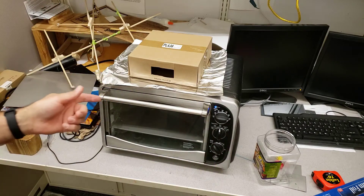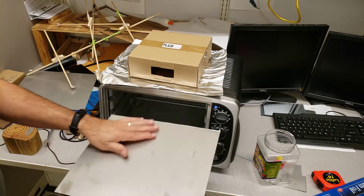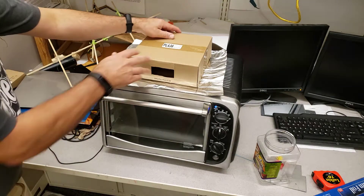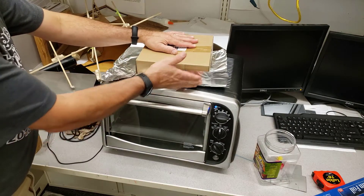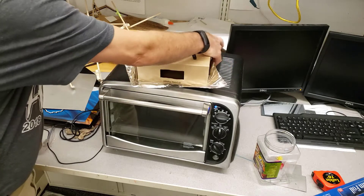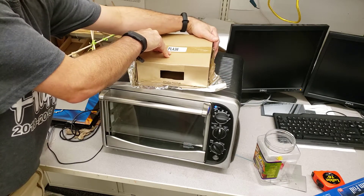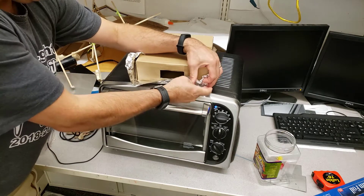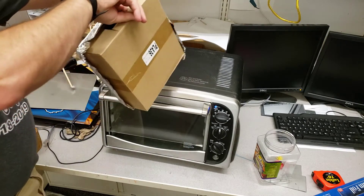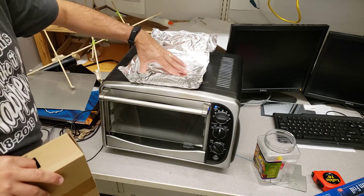So the project begins with the awesome toaster oven. A bonus is I found some flat steel and I was able to create a super flat baking tray that I put it on. Then I got tin foil and I make sure that the tin foil is super flat. I actually use a PLA box — this is what the plastic comes in for my 3D printers — to make a square container to build the melted plastic in. I tighten up those corners and then when I lift out the box I've got a nifty little baking tray that I can make sure is super smooth so that my plastic comes out as smooth as possible as well.